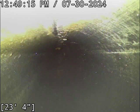So that end portion of the belly there obviously is quite minor, but because of how significant this belly is and how close these things are together, I'm mapping this out as one continuous belly. You would not fix this in parts and pieces. With as shallow as this thing is, there's hardly an installer out there, or repair guy, that's going to even try and do it by spot repair individually. They're just going to do this thing in one continuous go. Otherwise, you're unlikely to fix the belly, especially with the depths you're working with here.